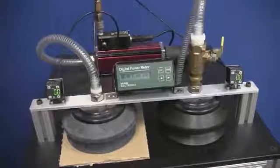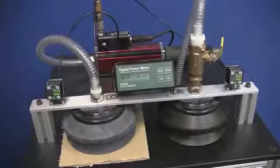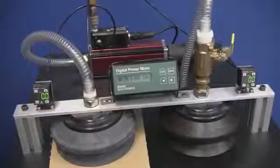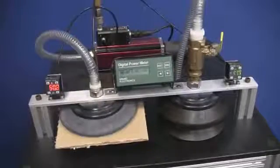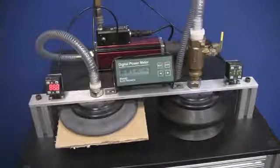Again, this means that the energy consumption of an air-driven pump is also very application specific. It should be calculated or measured by allowing for the duty cycle of the application, accounting for when the pump isn't in operation, as opposed to straight air consumption values from the catalog. When using compressed air, you can also adjust the supply pressure to the pump to help optimize its efficiency.